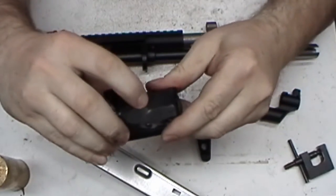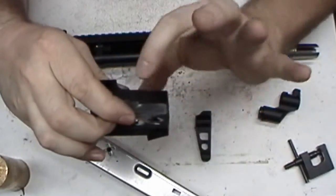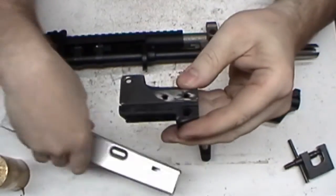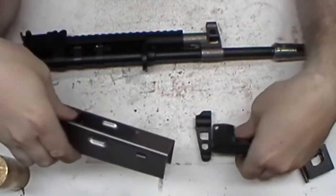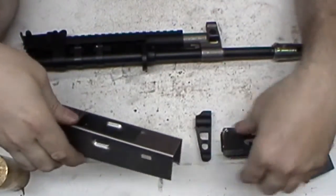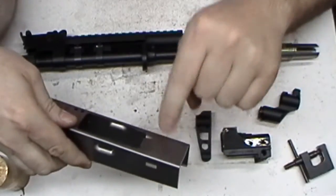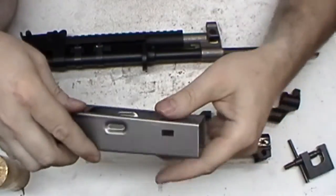And once you get this hole here, they give you instructions. They give you the dimensions from the front and from the side where to put the hole. Once you get that in there and you put it back inside, that hole will actually be a template now. Put the same size drill in it, and then you can run it through here, and that gives you your pilot hole to put the actual 6 millimeter or whatever size hole it is supposed to go on this set.